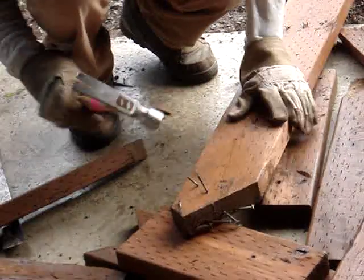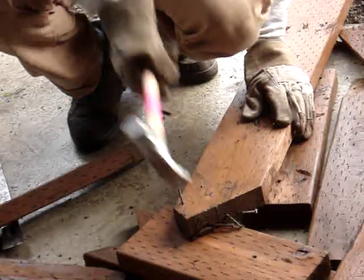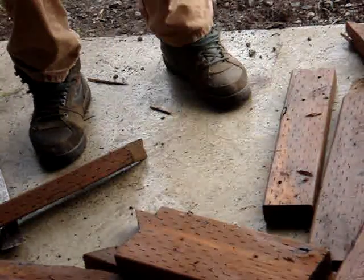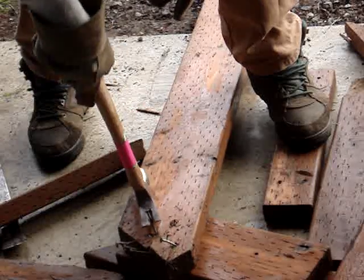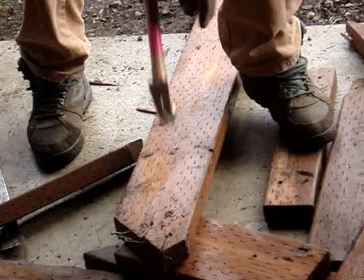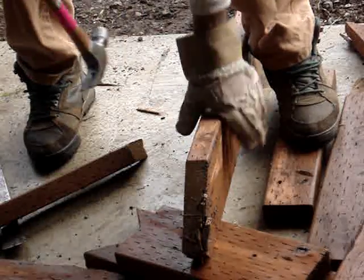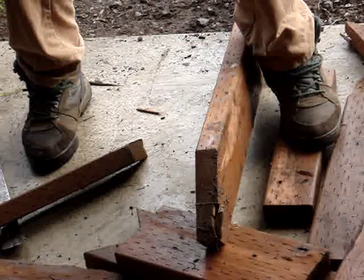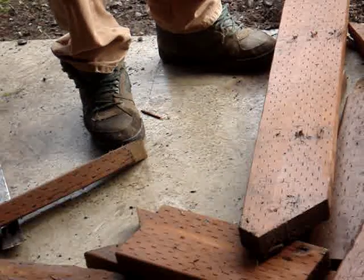Then you see you got some more here on the end. See, these boards here, this is a 2x6. I'm not sure what they cost now, but I know it's over $1 a linear foot. So this board here is about what? 5 feet. That'd be probably a $6 board or more. And when you're building little sheds, I'll tell you something, the price adds up quick, especially if you're putting them 16 on center or 2 foot on center. You go out and price the lumber, the building materials, build just a little 10x10 shed, even without a floor, you're going to be shocked. Because you should definitely use pressure treated as the footers. That's for dang sure. Or if you want to set some fence posts.